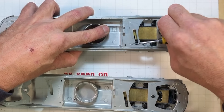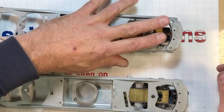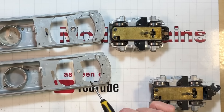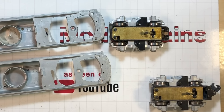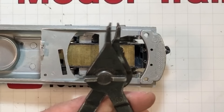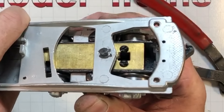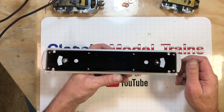When these go on the bolsters, the dummy one is held on with one of these Jesus clips. You can't do that on the powered one because it has a spring, then the motor bolts on and the top of the motor holds the truck in. So the frames are just the tiniest bit different. If you had a dummy frame — with no holes for the horn — and you know an accomplished machinist, a guy could certainly correct these two flaws. Just something to keep in mind. These are called snap ring pliers — squeeze this shut and the truck is captured, it can't pull off past the pin.